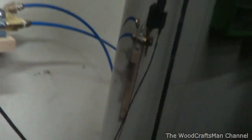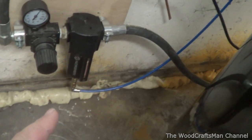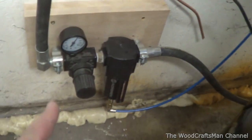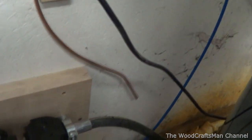The key to it is to make sure that they're both at equal pressure. The tank is at about 160 psi, and this water separator is also at 160 because it's before the regulator. The bleed off just goes to this small copper tube, and I kind of crimped the end a little bit so it's not as noisy.